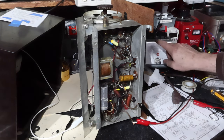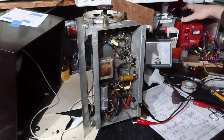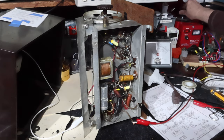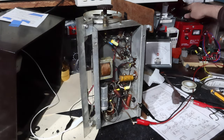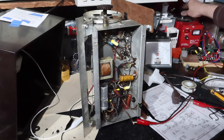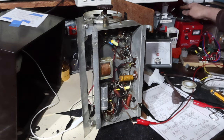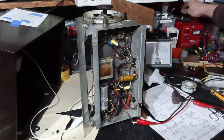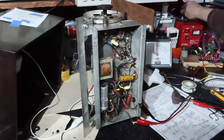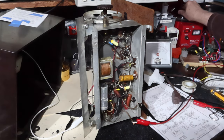So, be watching this. I have the dim bulb in the circuit, and turn this down. Here we go. Power's on. You see the voltage coming up here. I'm about 40 volts. Moving 120 milliamps. I know you can't see that, but I'm just telling you. So 60 volts. We have lights on the two bulbs that we installed. 70. Still 140 milliamps. 90 volts, 180.